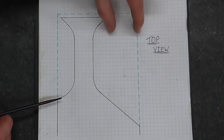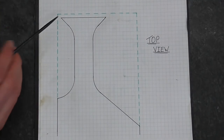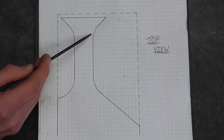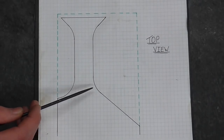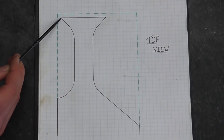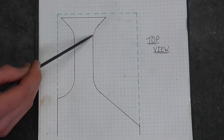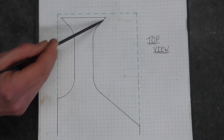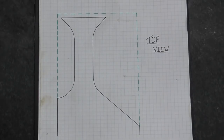There's the stock removal of this chunk, there is the end face, there is the forming of the actual cutting surfaces, these 45 degree sections, and then there is all this relief geometry. Now of course the only thing that actually matters here is that these 45 degree sections are correct. Everything else is just clearance, so as long as I get two 45 degree sections in the right spot with the correct cutting edges, then everything should work out.